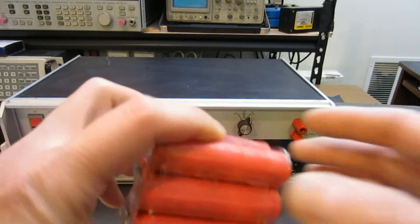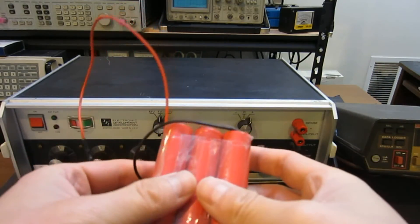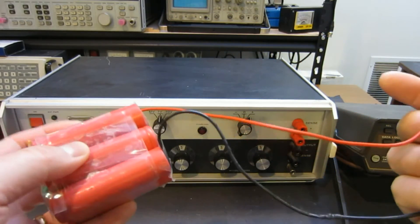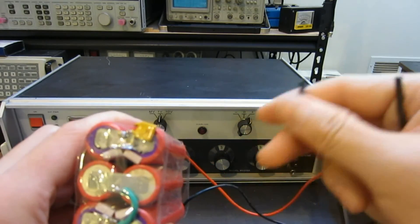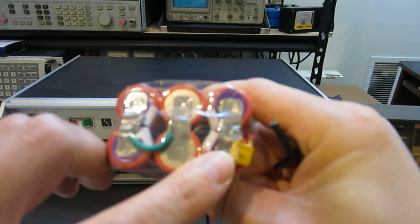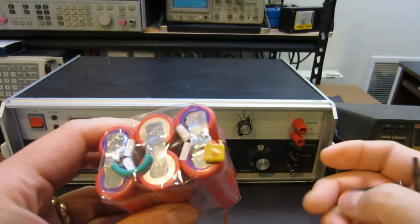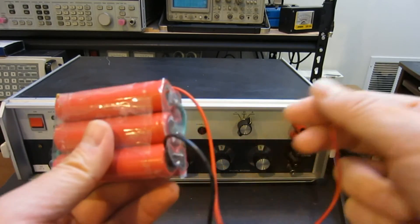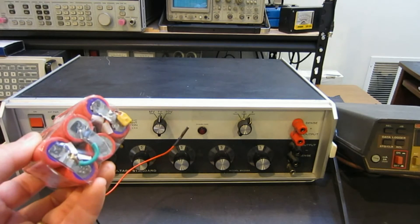Here's the external battery pack I built using used laptop lithium-ion batteries. This pack is two in parallel and three in series, so it generates about 11 volts in operation. Now, you need to be very careful when using lithium-ion batteries, especially this kind without the protection, because you don't want to accidentally short these leads and create excessive current that would start a fire and possibly cause some other damage. So for that, I added this polyfuse that would limit the current at about three amps. This is plenty for this voltage standard. I think when it's in operation, the average current would be less than 500 milliamps, so this would definitely be enough. So let's take a look at how we add this to the voltage standard and see if it works.